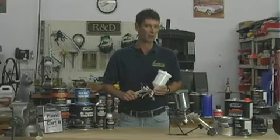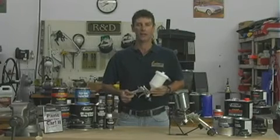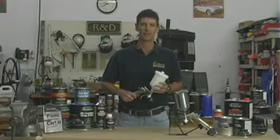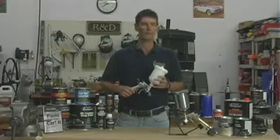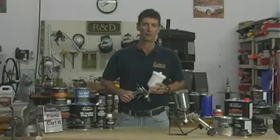And the reason why I say home use, it only requires 4 CFM, cubic feet per minute, at 29 PSI. This can be done with a standard home compressor. You don't need a big 220-volt two-stage compressor. You can do it at home in your garage.